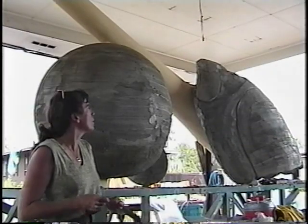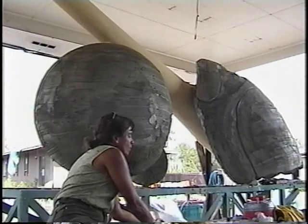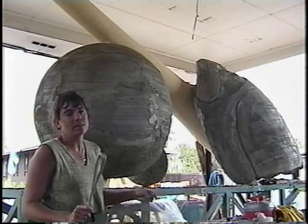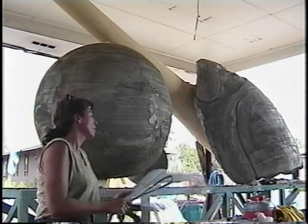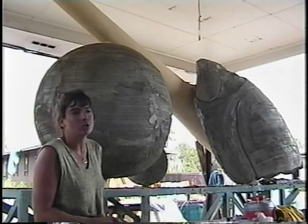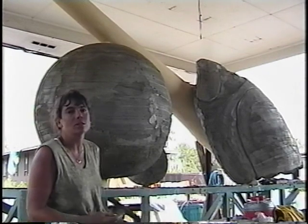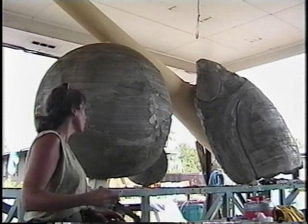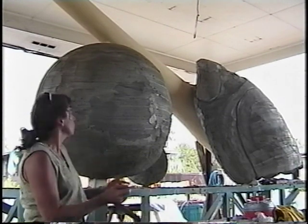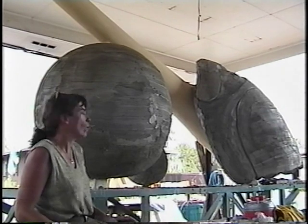The sculpture that you saw in the previous footage showed the steel armature. Since then, the steel armature has been covered with galvanized lath, which is attached with galvanized tie wire. That creates a form on which we can apply the first coat of stucco, which is called the scratch coat. The scratch coat is 1/4 inch thick, and it is used to stiffen the cage. Once the stucco is applied, it is raked with this tool, which, as you can see, will create a mechanical bond for the next coat to go onto.